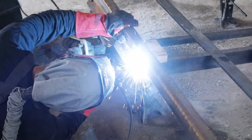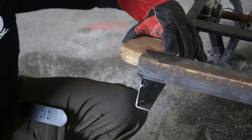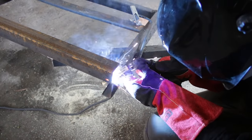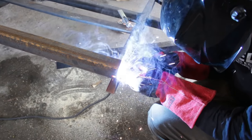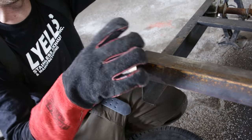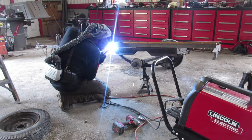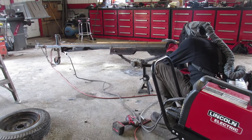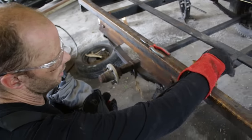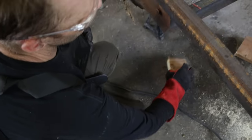Now if you're new at welding, you might want to flip the trailer upside down — it is easier to weld with gravity helping you. If you're a little more experienced, it should be no issue to run a nice bead along the frame. We'll do the insides at the back — give us lots of room there. Basically, have some fun with the welder, can't have too much welding. As your weld cools, it'll pull the steel one way. So if we weld everything on this side, it'll slightly lift up, and that'll help us get our 2x6 back in again.